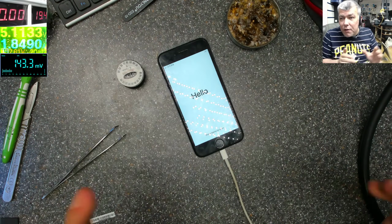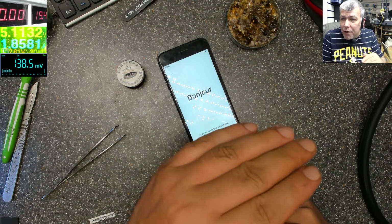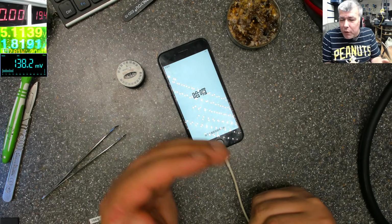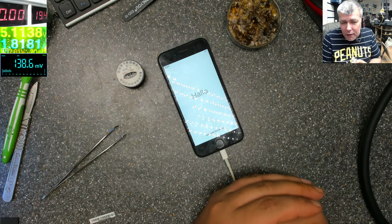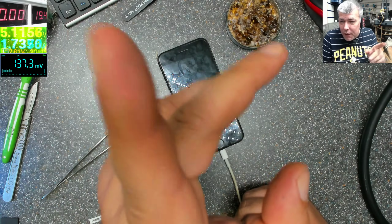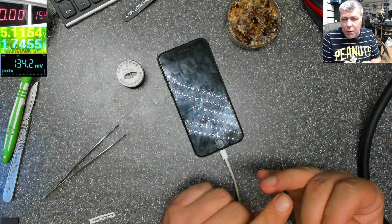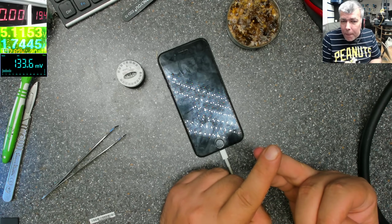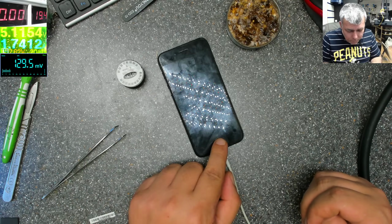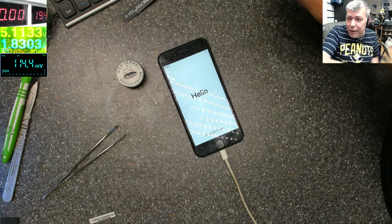So that's the way you fix this fault. But in this case, you don't really have to replace the transistor. You can jump over it. The transistor is there to switch. It's switching, but in the same way the output of the battery clock and data is switching. So it's nearly the same, you'll see no difference. Still charging, 1.7 amps. That's the way you fix this fault, when it's not charging, when it's charging only when it's off, or different weird things, like you plug the charger and you don't have the charging sign. Okay? It's charging fine. So I will stop now, because it's the lunch break.